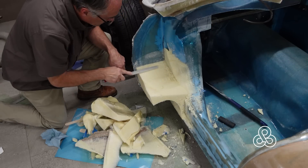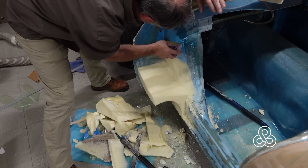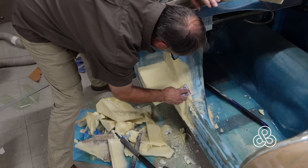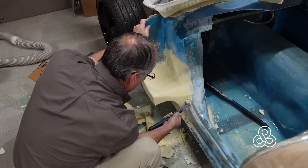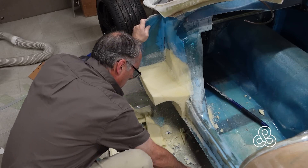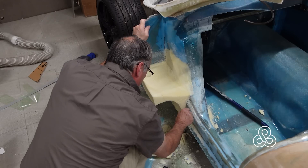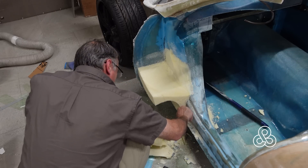I can run my rasp right up against the existing fiberglass work because in the end we will of course score that with sandpaper to get our bond onto the old fiberglass. Shaping this thing in with the rasp — with the rasp I can get a good flat smooth surface transition, but it comes down to getting a nice sanding block and smoothing this foam out. The foam is way too rough to work with, and I've mentioned how this works before in many videos: we always coat this foam over with a fiberglass micro balloon slurry to get a smooth surface to start doing our fiberglass work on.